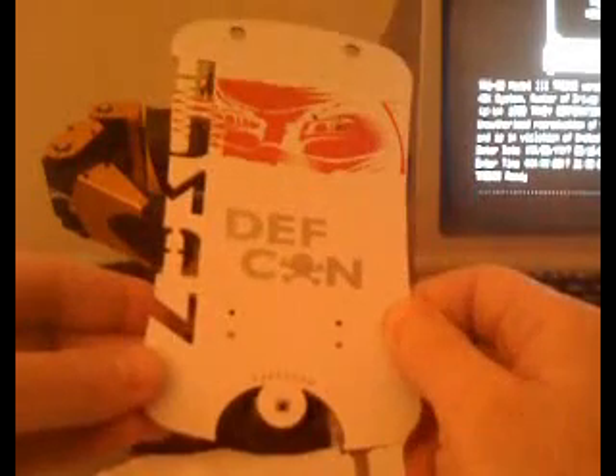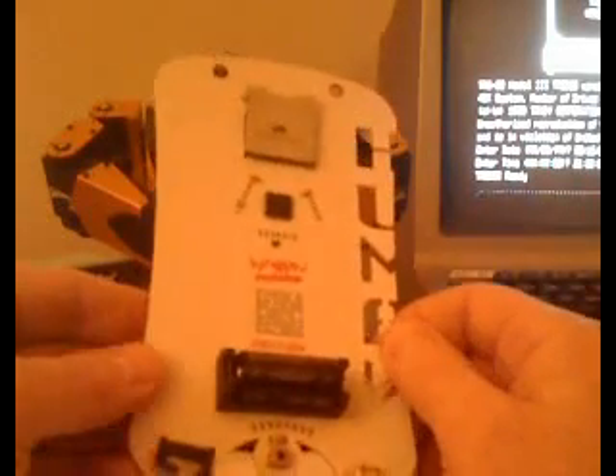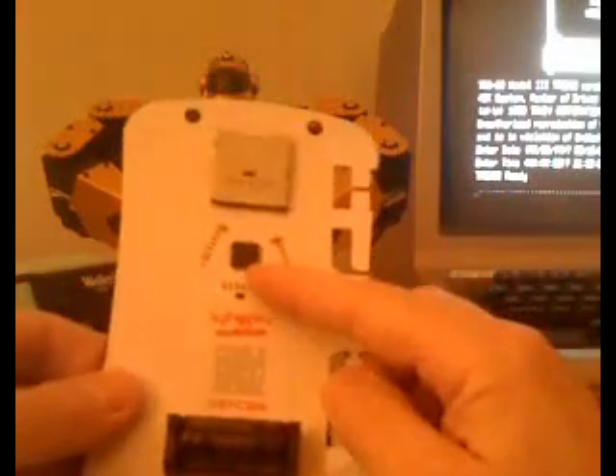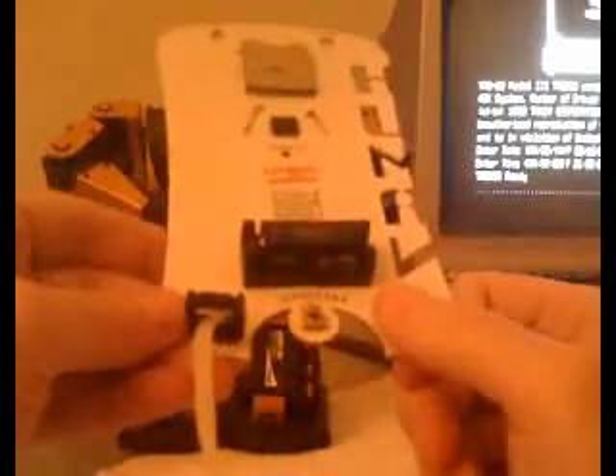You don't need a full computer to send 8 serial characters. There are many simple hardware dongles you can build that are capable of sending 8 characters over a 3-volt serial link. Here's one such dongle — this is my badge from last year's DEF CON 16 conference. My DEF CON 16 badge can boot my iPod Touch 2G. The idea is if I can get a badge to boot the iPod, then almost anything can. The DEF CON badges for the last few years have been really cool designs done by Joe Grand, also known as Kingpin. The badges contain little microcontrollers along with various LEDs and gizmos, but a simple modern microcontroller is certainly capable of sending 8 characters over a serial link. That's what I programmed this one to do. When I push this button on the back of the badge, the microcontroller sends the 8 characters over this little cable to the iPod, and that's all it takes.